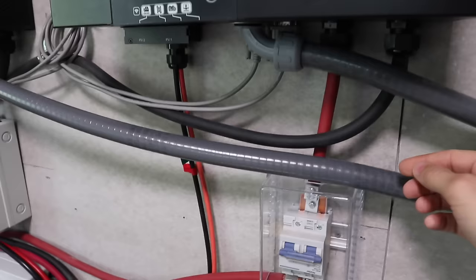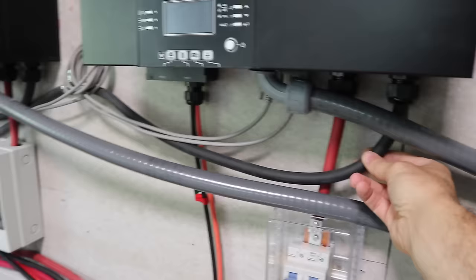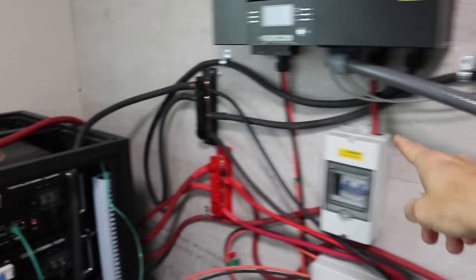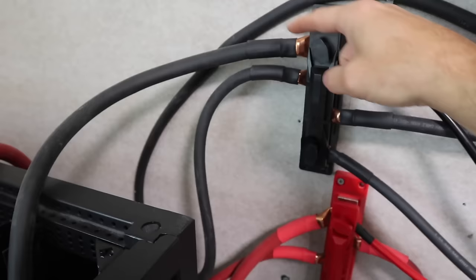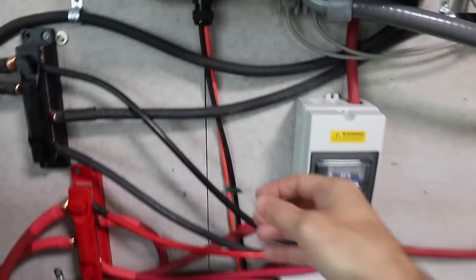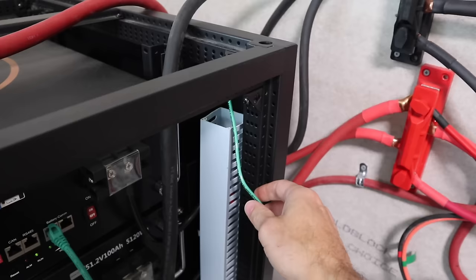When it comes to wire, you need to purchase wire appropriate for the size of your inverter. This is two-gauge battery cable — negative and positive — and they come over to what's called a bus bar. These bus bars combine from my two different battery banks, and going to the large battery bank we have some four-aught cable. There's also communication wire that comes with the inverters, so you don't need to buy that. You'll also need wire for grounding parts of your system. Finding the wire and breakers can sometimes be a big challenge — I've got links in the description. That battery cable is used for welding mostly, and it's the best thing to hook your batteries up to your inverters.